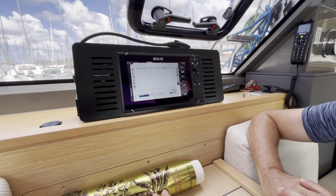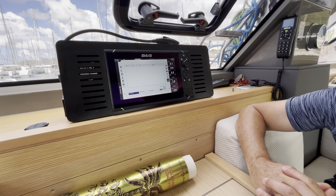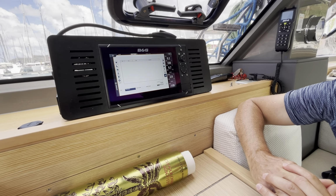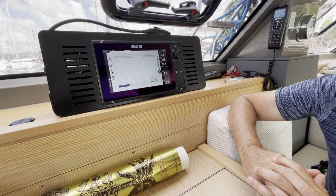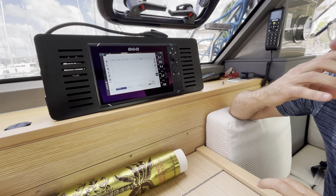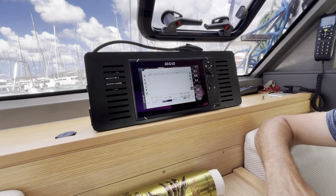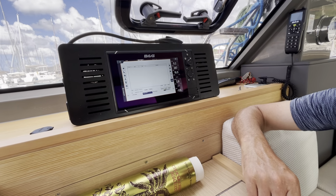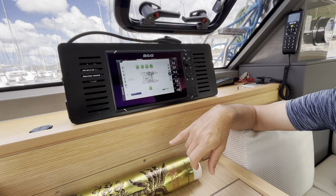And then if you have an alarm, it'll appear here with the description. I mentioned before that when you run both engines at speed, particularly if there's any solar, an alarm will come up to say current overload, and it's done it from the day I got the boat, and there is no current overload. It is simply a line and a code which was set some time ago, and no one's changed it. Let's look to see if it shows here. Only the from-to. I guess you'd have to change the dates to see. I don't know how long it keeps this. Yeah, we're back here.